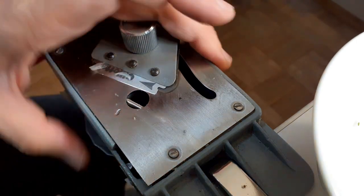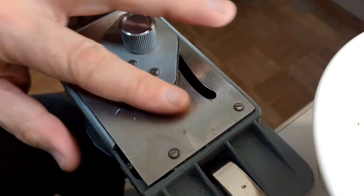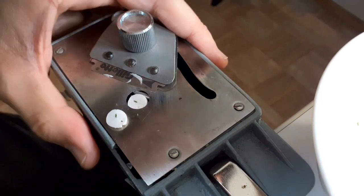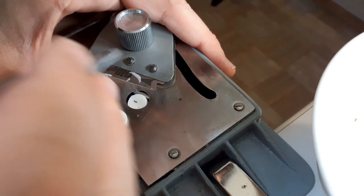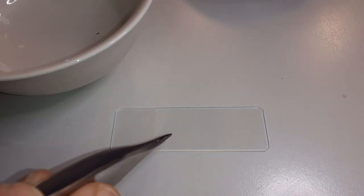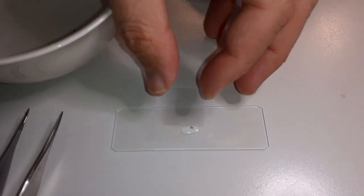I've heard that sometimes people use the thermal expansion of the specimen to determine slice thickness — especially with frozen specimens. If you let a frozen specimen thaw a little bit, the thermal expansion alone is enough to control the thickness of the slices. I'm trying several more times because the sample slipped in too far, so I have to use tweezers to pull everything out and give it a new start. In any case, I've got enough samples floating around in the water now.